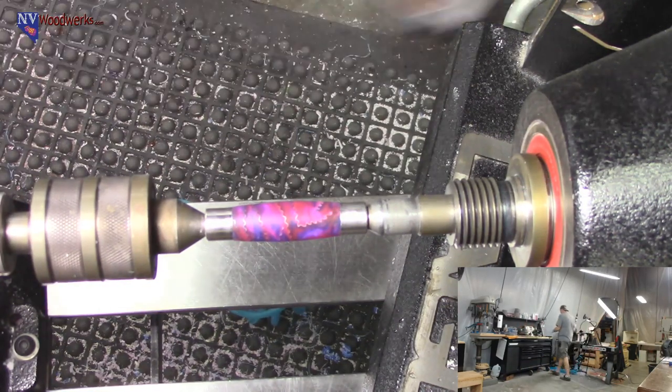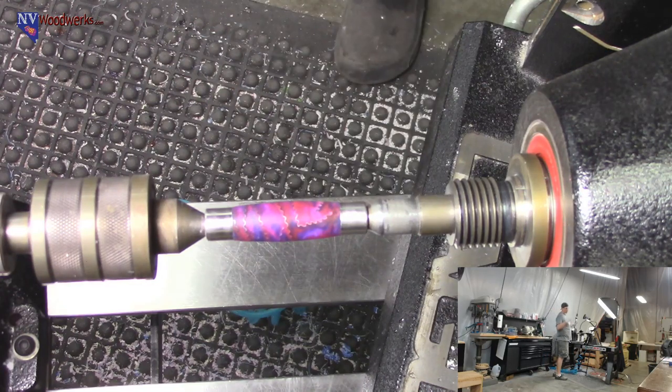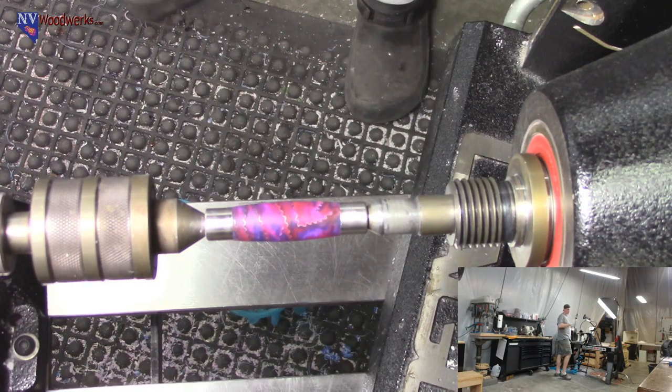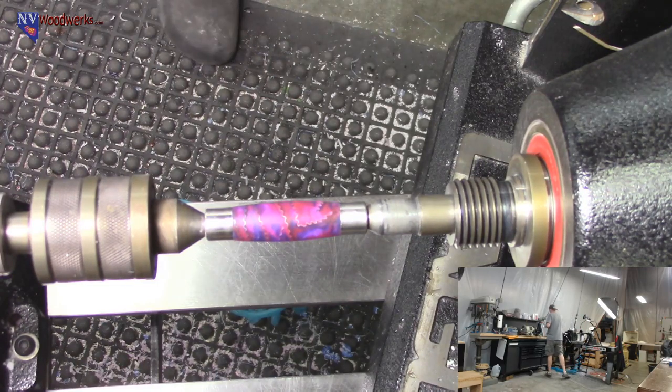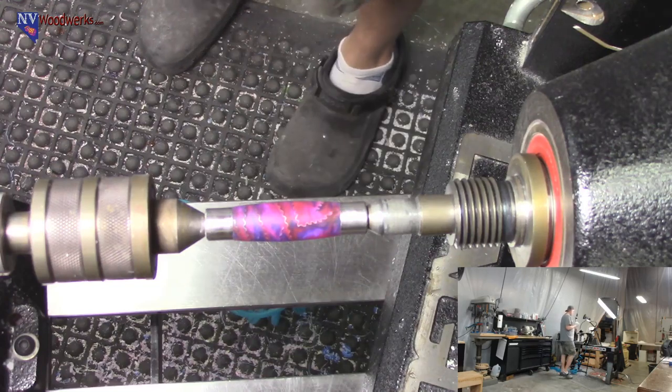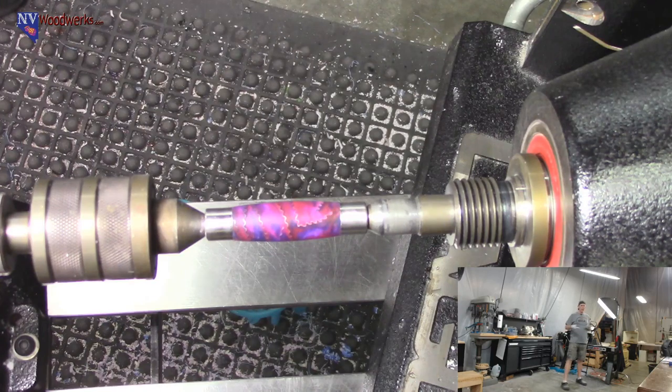So let's see, does anybody have any thoughts about sanding your bushings? I prefer Mirka. I've been using Mirka brand for a while, so that's just what I bought. But you can use anything. I do recommend, don't get a cheap one. Don't go to Harbor Freight and buy sandpaper. That stuff sucks. Buy a reasonable brand, like Klingspor or 3M or Norton. But any wet dry sandpaper, silicon carbide should do the same.